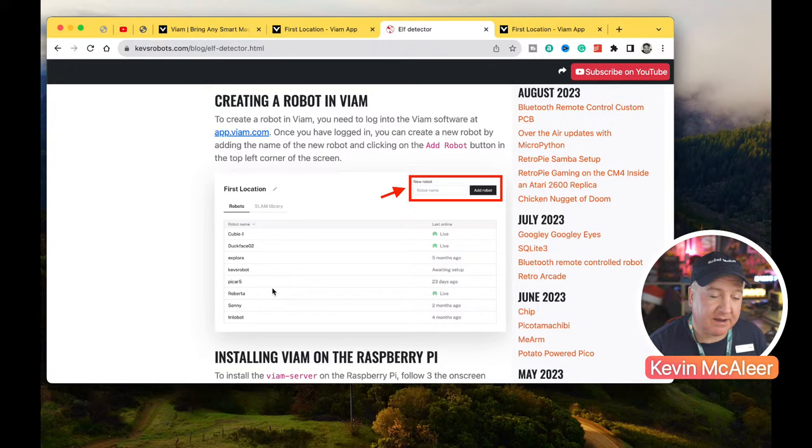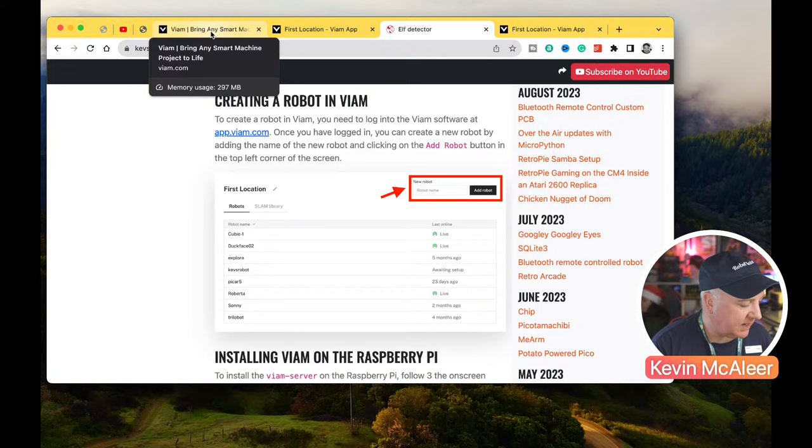The original Raspberry Pi web camera, which is like version 1 and 1.2, they use a particular type of sensor, and that exposes itself in the Unix file system, and you have to have a driver that can understand that format. And then the new modules, the version 3 modules, have a completely different driver set, so they would have to update that. I know it's on their roadmap to do that, but it isn't there just yet. And I haven't tried it with the older web camera to see if that will work.